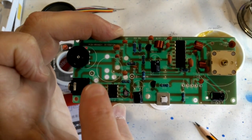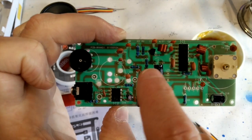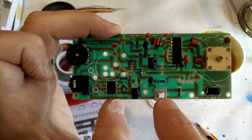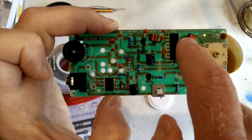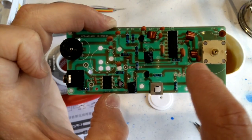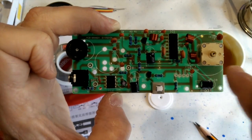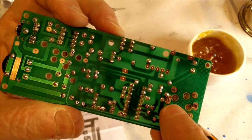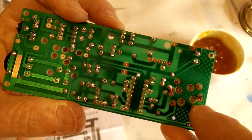I've just about finished adding all the components. I've got the headphone jack, the volume control, and the switch. I've got these little chokes or coils installed - those were done by count, getting a number of turns. This one has five and a half turns, the other two have six and a half turns. Some of the coils are perpendicular to how they're displayed on the circuit board, but I don't think it makes a bit of difference. I haven't soldered in the tuning capacitor yet because the tabs on the back are a little crusty, so I'm going to put some flux on them.